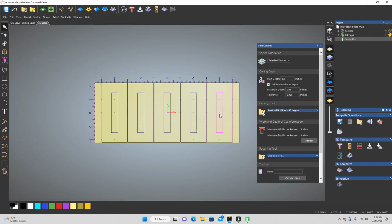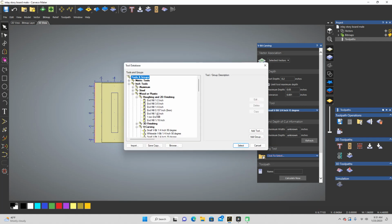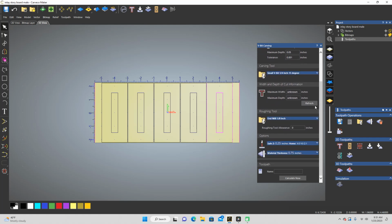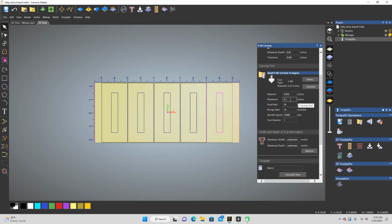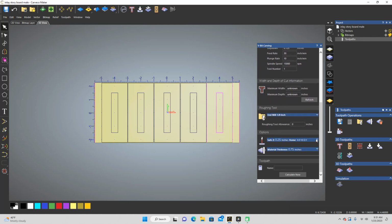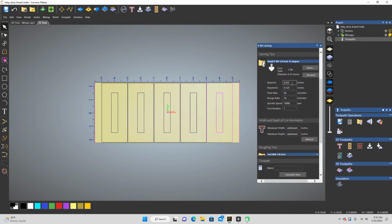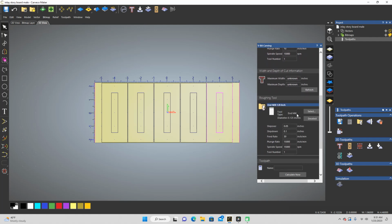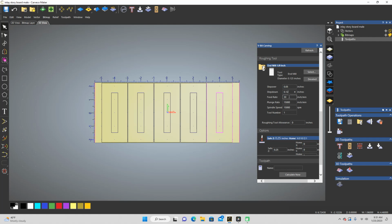But I'm going to do one carve with these numbers just so I have it on the storyboard to compare. So these are my original numbers that I did the cutting board at. I got the 15-degree, I got the 1/8 inch, and I actually did a step down of 0.125. And I don't think that's really going to change because of these numbers, but I'm still new to this, so it might be something that affected things.